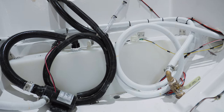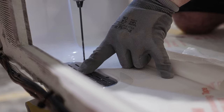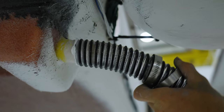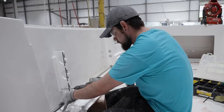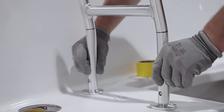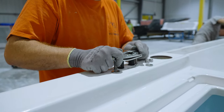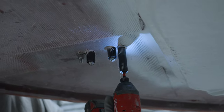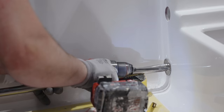Other components such as freshwater tanks are also fitted with hoses that will be later attached to the deck. Shifting attention to the deck, it undergoes a very similar assembly process. Work begins with plumbing the self-bailing collector boxes on the deck. Parts get installed in precise spots matching the reinforced areas from lamination — a perfect example being pull-up cleats, where aqua steel provides the required support and load distribution. Many components are installed during this step including the boarding ladder, cockpit toe rails, and courtesy lights.